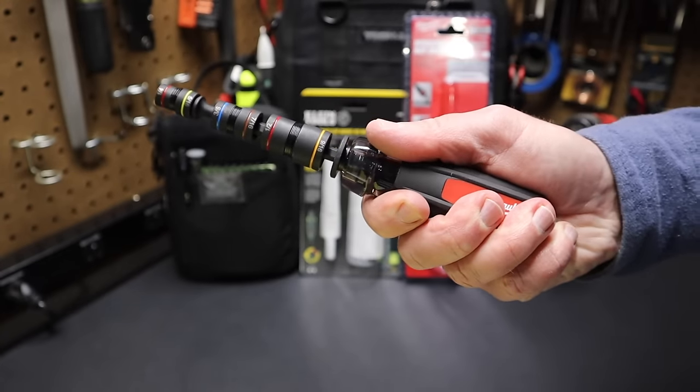I have links to these products in the description. For me it's kind of a toss-up. I like that the Klein has the bit driver feature, though I don't use it a lot. The Klein also fits tighter spaces. But I like the Milwaukee's smoother beveled edges and the flange that keeps sockets from getting knocked off. The markings are better on the Klein, and I definitely prefer the Klein handle. It comes down to whether you want thicker-walled Milwaukee sockets with the flange, or Klein's ability to accept bits and fit tighter spaces with larger, easier-to-read laser etching.